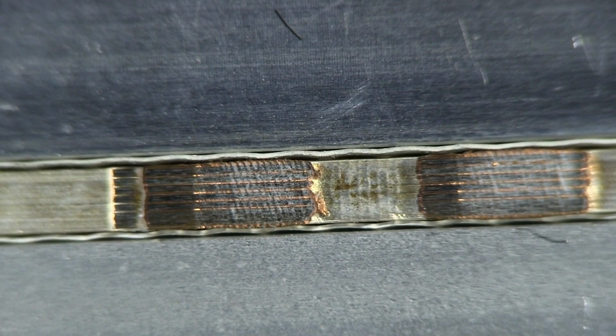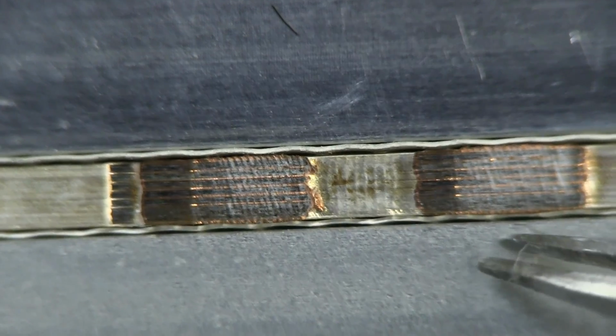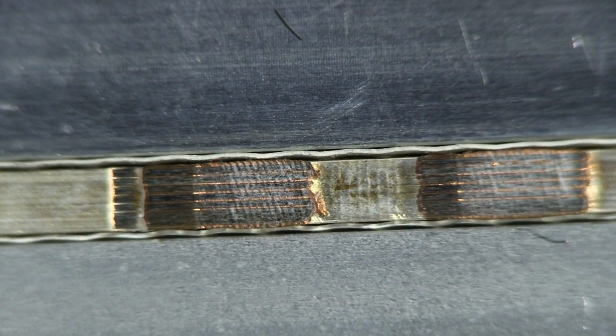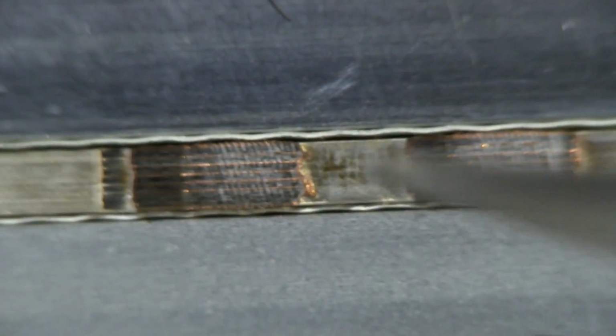Now, a bit of context here, if you're not sure what you're actually looking at, you've got the top aluminium block up here. Sorry, I've got this propped on an angle. It's going to bounce around a bit. Bottom aluminium block in here, and the multi-layer PCB wedged in there. This is actually the tracking gen module, or what I believe is a tracking gen module, and you can count the copper layers in there.